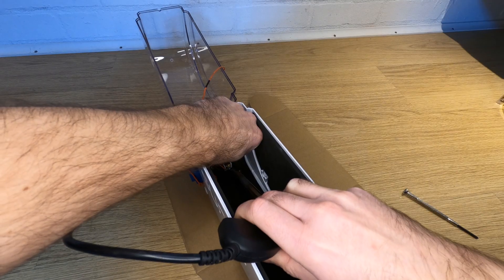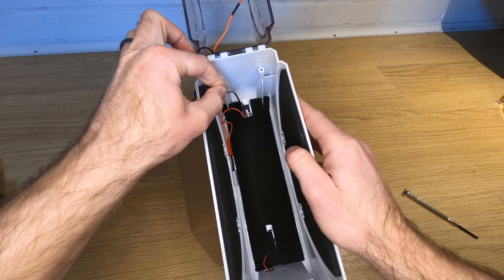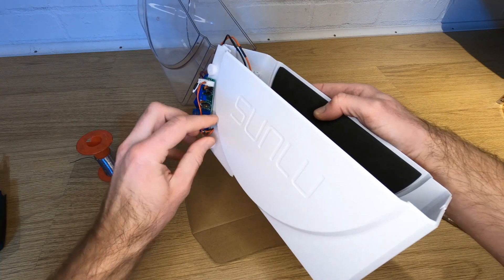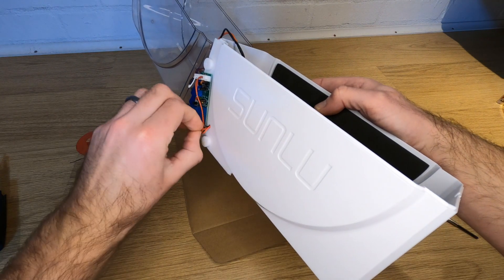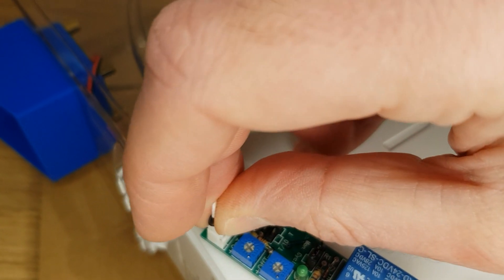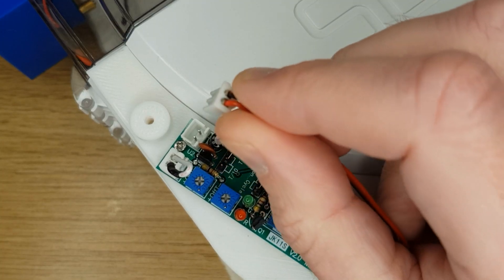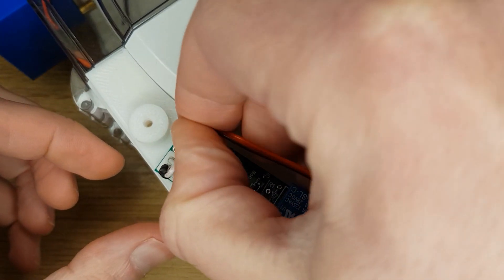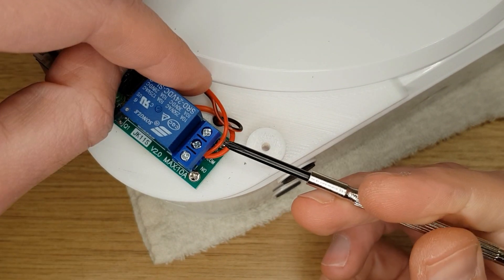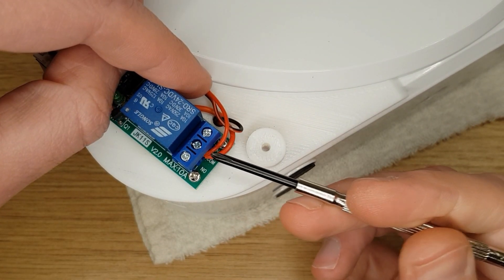Now we can wire it up. Wire one side of the thermal switch to the positive pin of the socket as in the simple option. But instead of wiring straight to the fan, feed the other side of the switch out of the side hole. Also wire together the two wires for the switch plug so that the relay is constantly activated when it has power. Connect the plug for the relay power connector, run the red wire to the bottom of the board, and connect both this and the switch positive feed wire to the middle terminal at the bottom of the board.